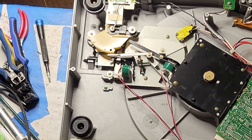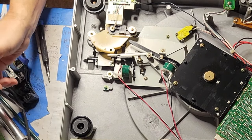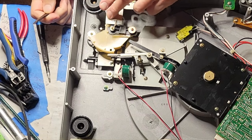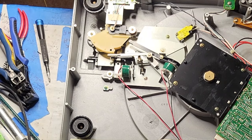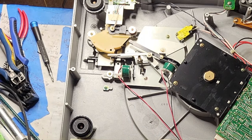The obvious next step is then to check the continuity between the connections here and the connections on the tonearm. See the masking tape there for strain relief on these wires. They all look fine — it doesn't look like they've been insulted in any way. Nor does it appear that there's any kind of switch mute thing that the signal needs to pass through. I should have been able to scrape the needle and hear it over the speakers even with the power off. So there's continuity in the board and continuity in the cable here, and so then the question is about continuity in these wires.